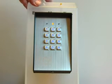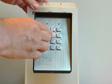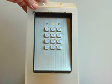To change your relays to toggle mode for relay 1, you would press 4, 1, then pound. To set relay 2 to latch or toggle mode, you would press 5, 1, then pound. Confirms acceptance.